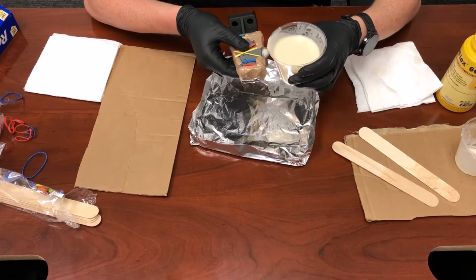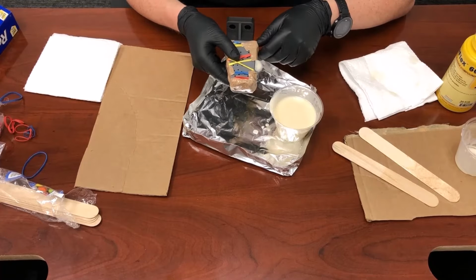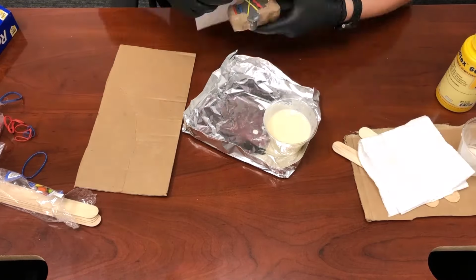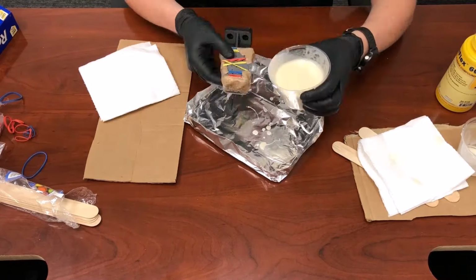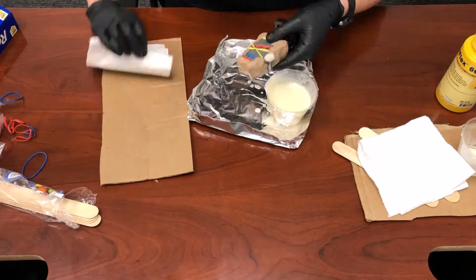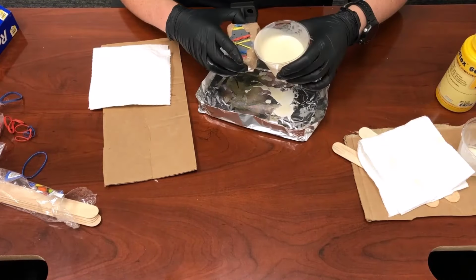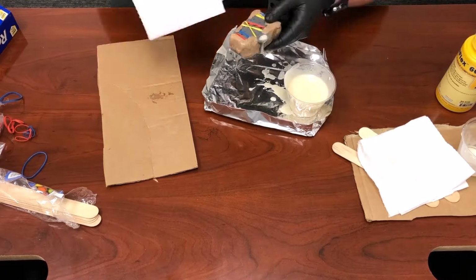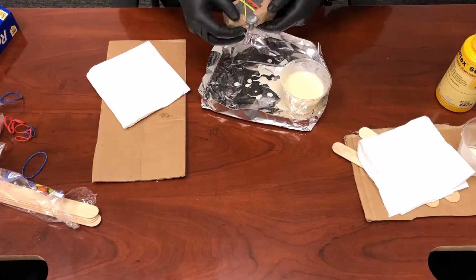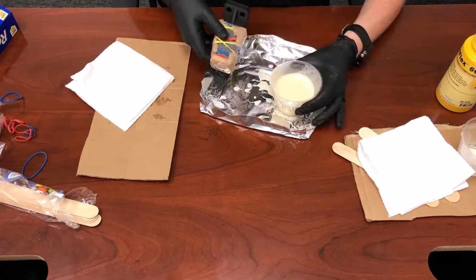This is what this pouring process looks like. I will say that this mixture is maybe a step under honey in terms of viscosity. And because this mold is a constricted environment, not a lot of surface area, relying on gravity to pour this resin in is not advised. I definitely would recommend a syringe. As you can see, towards the end of pouring this, I had to lay the paper towel over the pour spout and blow the resin down into the mold, which is not pleasant. A syringe is such a better option. So yeah, word to the wise there.